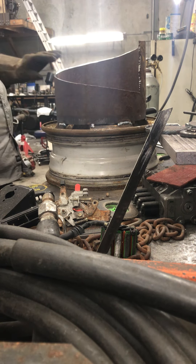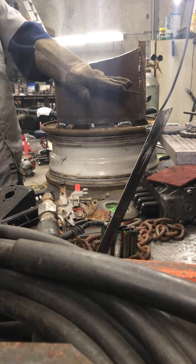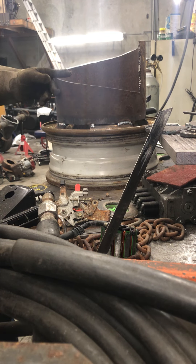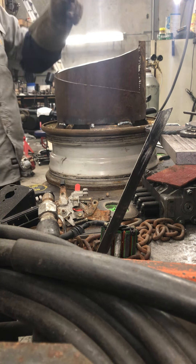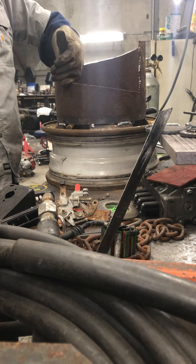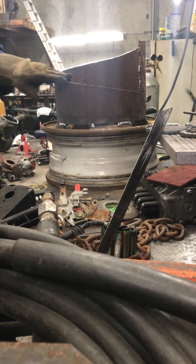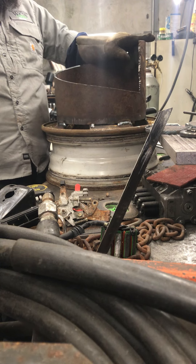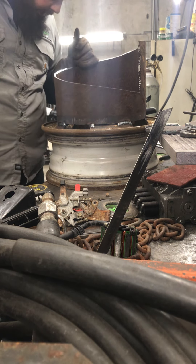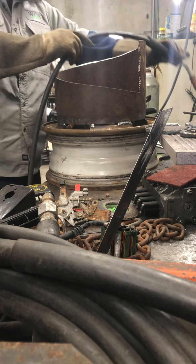Looking pretty good. I already got my nice 60-degree bevel cut onto there. I lowered this profile a little bit just so I got more room. The 60-degree angle starts about a little over halfway around the circumference of the cutter, so I've got about a 10-inch window to start feeding into before it grabs the wood. I left a flat face on the corner so I can go through and put the little hook grabbers in there if I need to. I'm going to finish getting this welded up and I'll bring you guys back later.